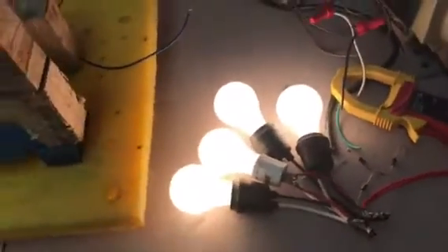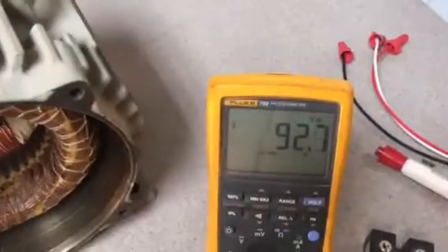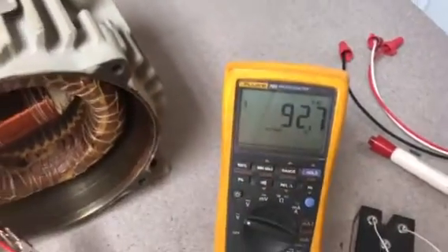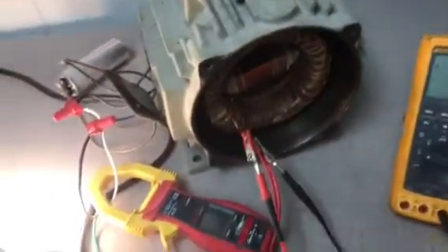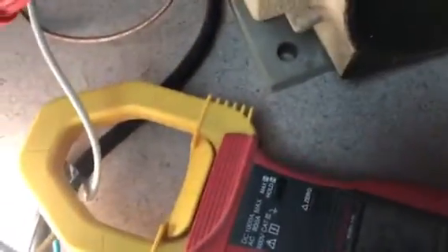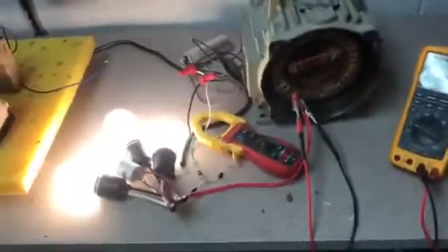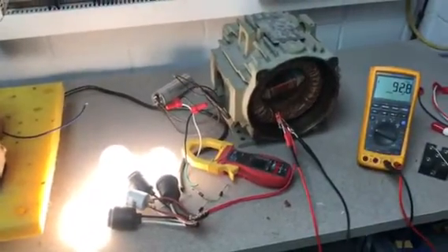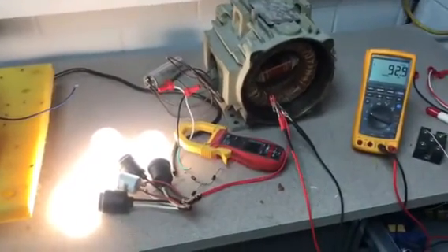The lights are almost at full brightness, and it's showing 92 volts. There's a drop because without the lights it's around 110. The amps it's pulling — let me show you — okay, 3.6 amps. That's what I have for now. I'm working on the core with laminate to see how that works better.